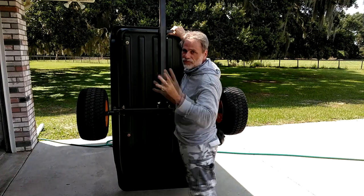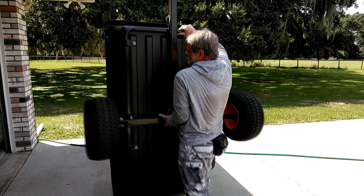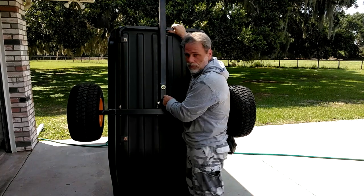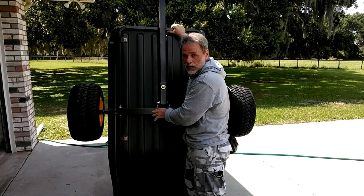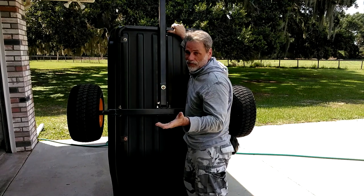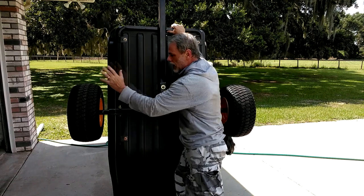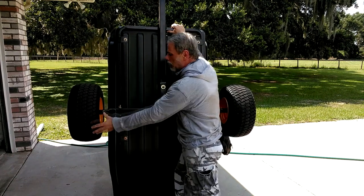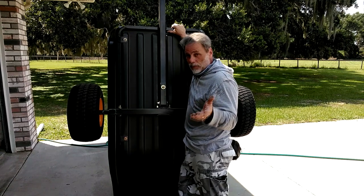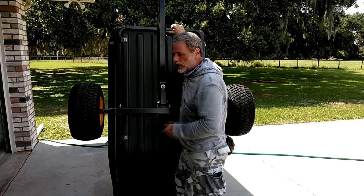There are basically four parts to this: there's a circular frame, the main bar — the tongue, a swivel piece, and basically the bracket for the wheels — the axle. They're independent axles, little tiny axles on the side, and the wheels just mount right off. Misdemeanor helped me figure out that the extra washers aren't really extra — they go on the inside and outside of the wheels so the bearings stay clean and healthy.